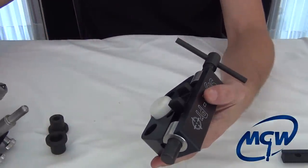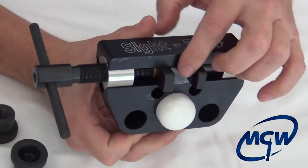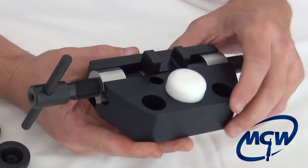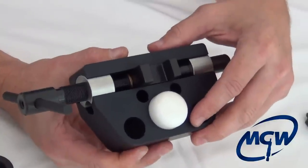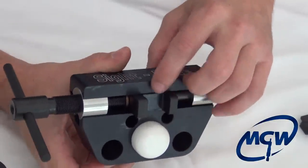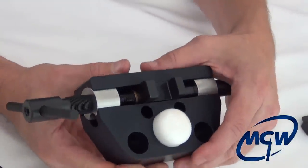Let's talk about the upper carriage for a second before we put it onto the slide. This carriage has a block with plenty of clearance, so it should remove adjustable sights, Novak style sights, and just about any sight on any particular gun. It has almost a half-inch deep by over three-quarters of an inch wide slot.